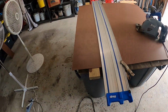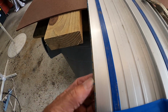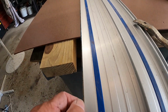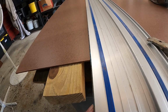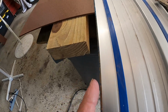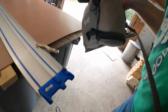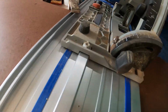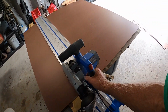All I've done, when you first get this rail saw, there's a plastic piece on here for cushion, because this is aluminum, you don't want to run your blade through aluminum. That plastic piece is normally out to here when you first get your saw. But this saw right here, there's a groove right there. See that groove? It falls right in on that track. Now you have a saw that slides here, okay?